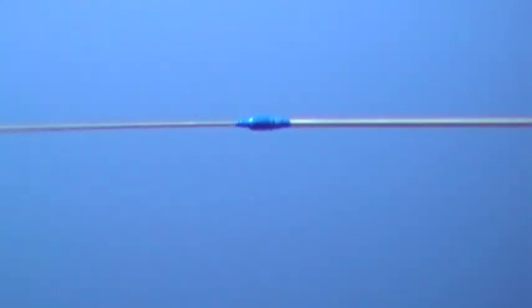But if you look at this, you can see where I've got the tape that's overlapping the inner and the outer section of the reflector. So this is what I was talking about reinforcing it. This way it's not going to fall off on you. And also, as I mentioned, absolutely use Loctite on all of the pieces on the antenna. So you can see what I've done here, and as mentioned, I went an inch above on the smaller radial and crossed over it an inch on the other side to the larger one where it's mounted into.